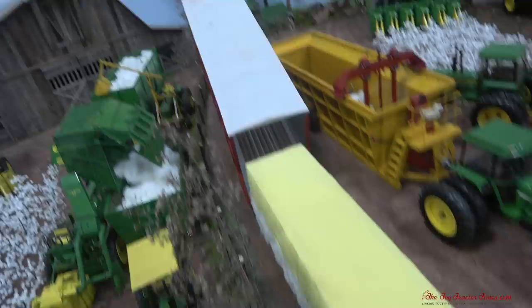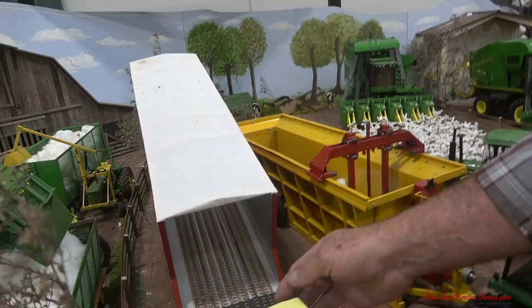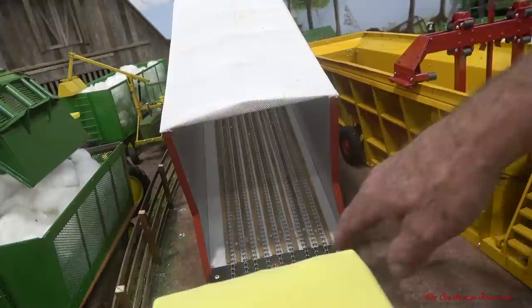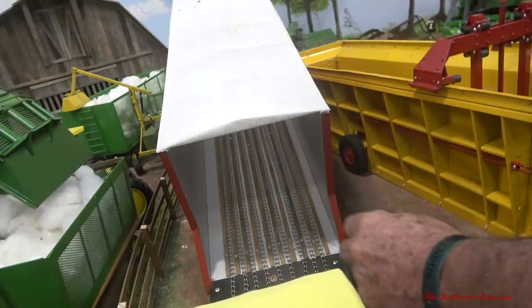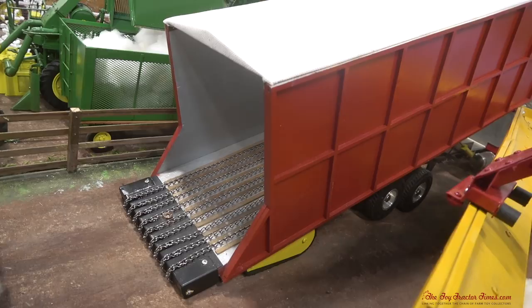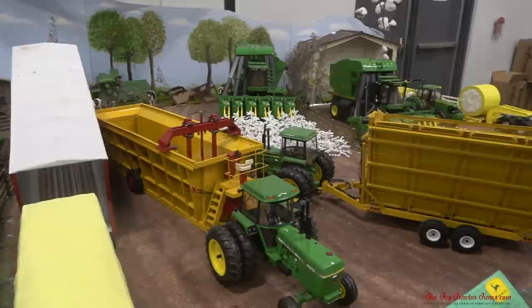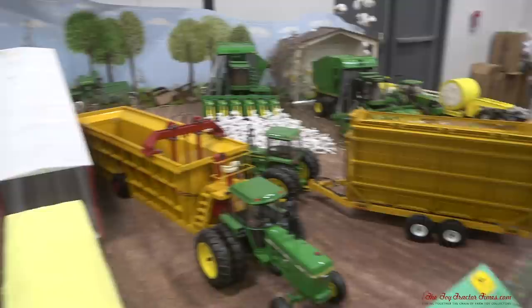Here we had the wagons and we were trying to haul it in — but in order to transport these modules to the cotton gin, they had to come up with a special truck. This truck actually had a belly chain along the belly of the truck. It also had tracks, much like a little dozer. The tracks would sync with the chain, and it would back up to a module and pull the module into the truck. That's how these modules would be hauled to the gin.